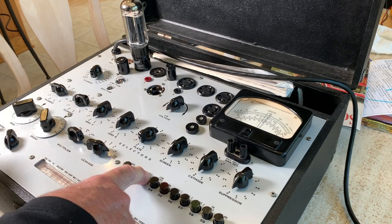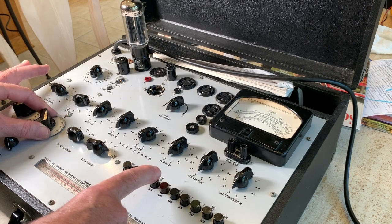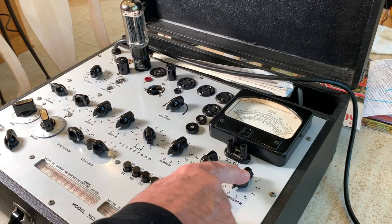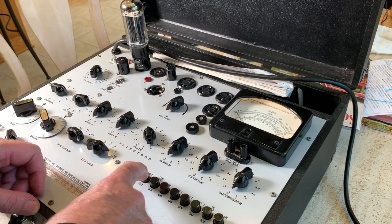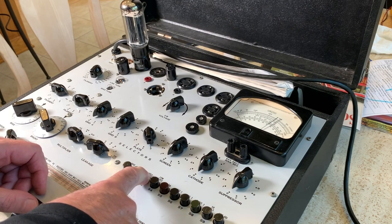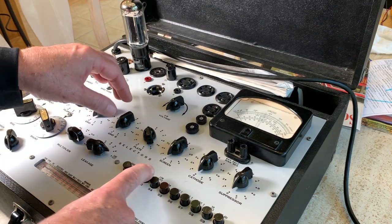And now we'll go to the other one. Let's see, 35. We'll set the shunt to 30. Bias at 0. This plate will be 4000. Push S3. See what happens. Oh boy, that side's up to over 900. 30, 4,000. Yeah, so that side's pretty strong.